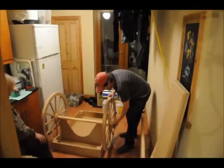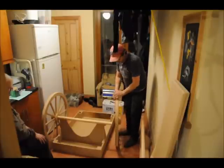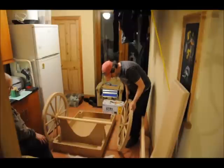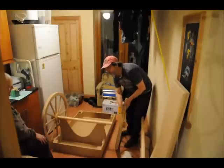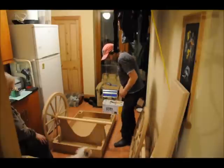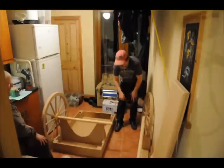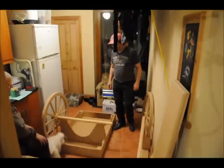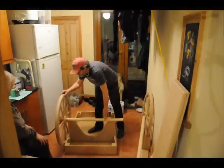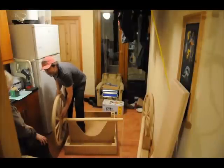The shelves — it's quite tight at the moment, but when you've painted it all — you might want to paint it in bits and pieces, you don't have to do it all together. You could paint the wheel. It'll want a coat of varnish; you've got sanding and that'll all come off. Then a coat of varnish, and then of course it'll bring up the fluff. Then just give it a quick sand with some fine sandpaper. When it's all done and varnished, what I would do is just spray inside there with some Mr. Sheen or some sort of silicon polish. That'll make it really nice and slippery — because it runs okay, but it's a bit tight. Otherwise that'll wear, and it'll squeak. You don't want to be putting around squeaking — you've got the dog squeaking, and then this squeaking as well.